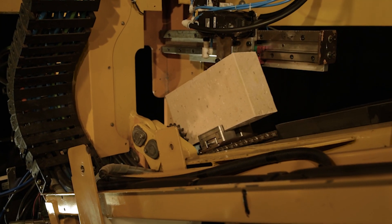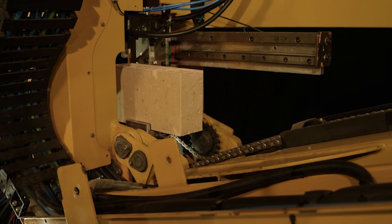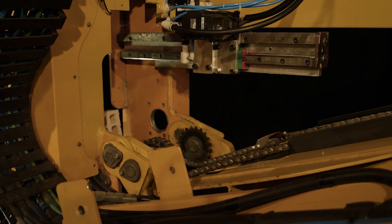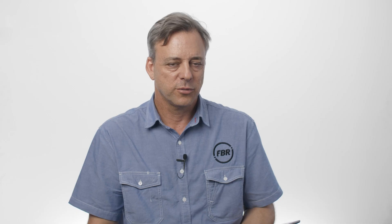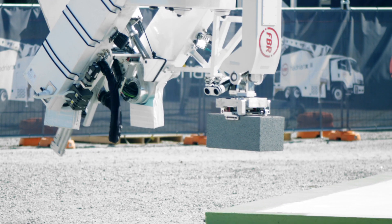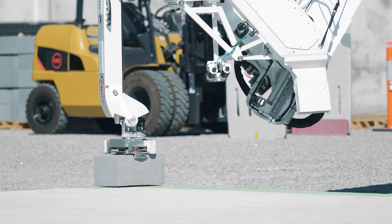The next step is to introduce DST and do it with a moving boom. This video is looking at one of the concepts we had for glue application — here we're moving the nozzles over a stationary brick. One of the problems with this is it couldn't work with a boom heading up vertical. So on Hadrian 109, there's a flipper which grabs hold of the brick and brings it horizontal before applying the glue, which can handle all different kinds of boom angles.